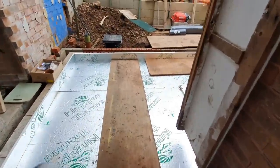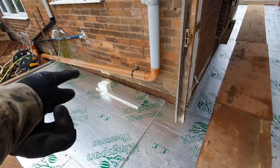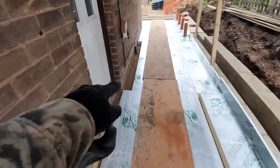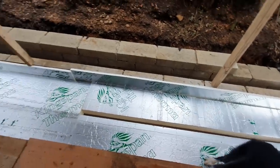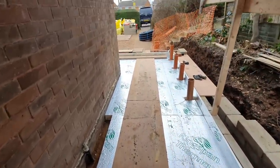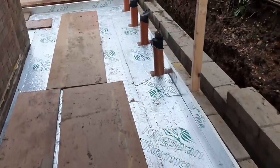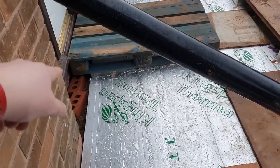We've got all the insulation down. We've got a spare sheet of 25mm there - we didn't need that, but if the inspector wants us to put any insulation up against the internal walls we'll have enough. We've just got a sliver here and a sliver here which we're short of, but I've got some 100mm at work that we use for the cold rooms - some off cuts from the cold room doors. It's all the same stuff, Kingspan thermoboard, so we'll go and have a look for some of that and bring it back. We've got all the way done - I'll be taking this back up over the weekend just to drop the DPM underneath.